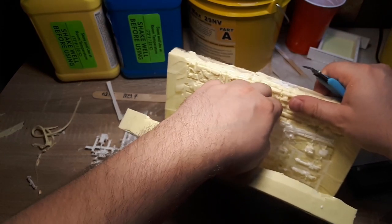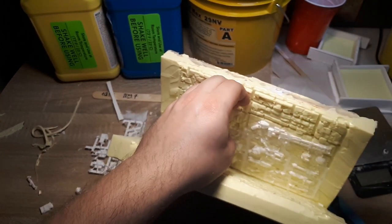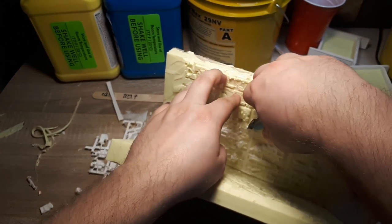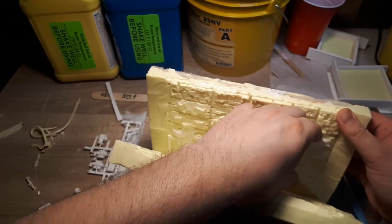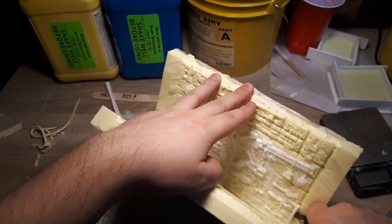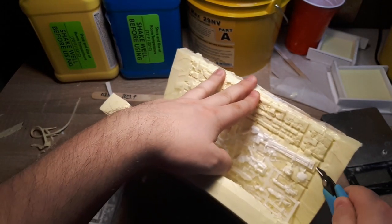This particular case was very strange to me because it didn't seem like the silicone had bonded to the liquid plastic. I mean, I definitely used enough mold release there. I think it might be the fact that the inner wall reinforcements don't allow me to bend or twist the mold, which means that there's a fair amount of vacuum behind the parts as you're trying to pull them up, and that's why it takes extra effort to pull these parts out.